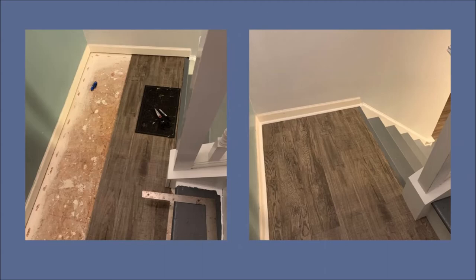We ultimately went with vinyl flooring, and I cut the vinyl with a combination of a utility knife and heavy-duty scissors. These are vinyl planks, and the pieces are held in place with a combination of construction adhesive, quarter round, and nailing the quarter round to the subfloor rather than to the base. The total time spent on the landing was roughly 2 hours.